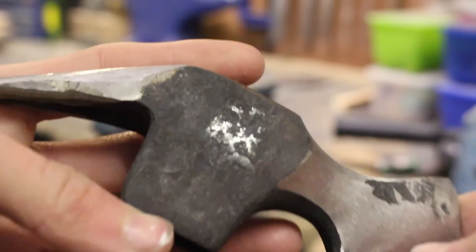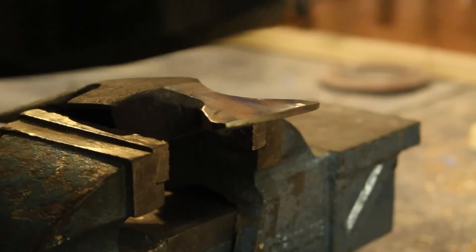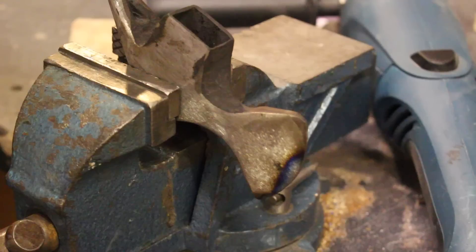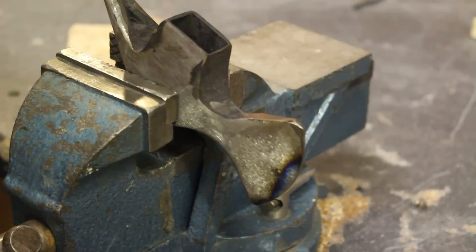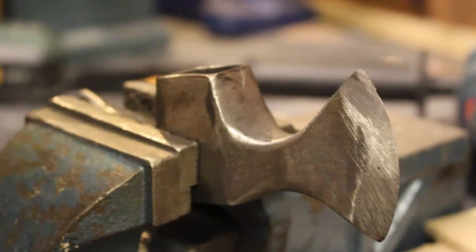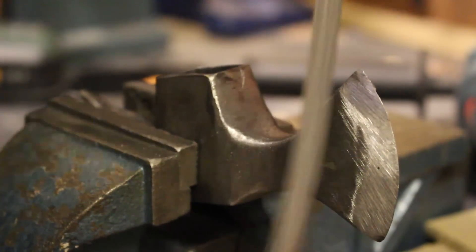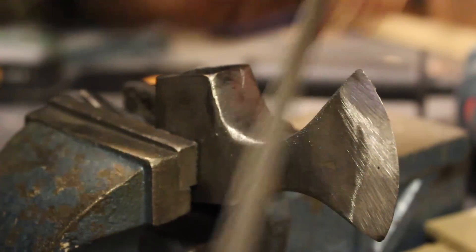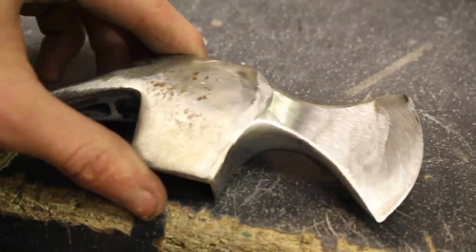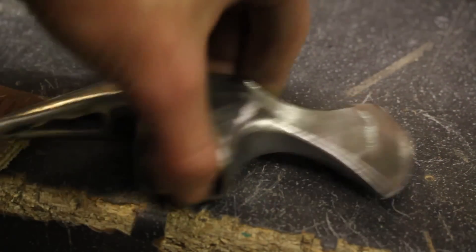I did a little bit of rough cleanup but nothing much on the back side. For the cleanup and general shaping of the tomahawk blade I was using an angle grinder with an abrasive flap disc. The angle grinder can't reach into all of the different corners of the axe, so for some of those corners I was using metal files. This is what it looks like after the final profiling and I'm quite happy with the overall shape — it looks nice and sharp.